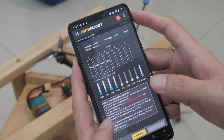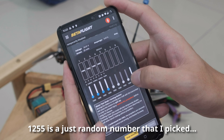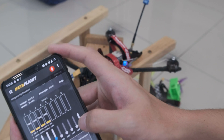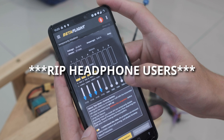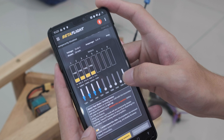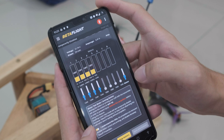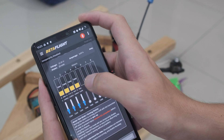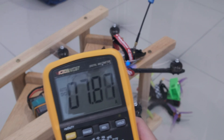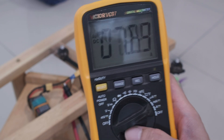In the motors tab, I'm going to hit a target throttle value of 1255. Let's move the master throttle up slowly until we see the value go there — your motors are going to spin up, so be very mindful of that. Let's go to 1255. That's going to be our total current reading, which comes in at 7.9 amps.